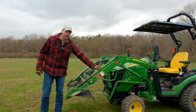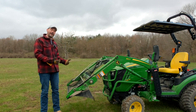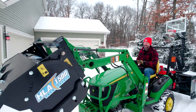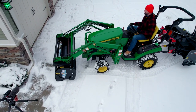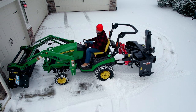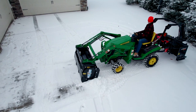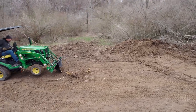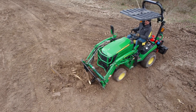Take a look at this rod — it's part of your curl roll. If you have a bucket full of dirt and you want to dump it, this is how you would dump it; it's made to just release material. However, if you are pushing and pulling with the stump bucket in this kind of scenario, you're really looking to cause problems on your tractor. Same thing can be said with the snow pusher — with the snow pusher you're on a smooth, level, clean surface and you don't need to be fully extended anyway. If you are driving forward or backwards and just digging into the ground against a stump with the stump bucket, you're going to have problems. Backhoe cylinders have the same kind of issue — they will get bent and torqued. You'll never see me with my stump bucket fully extended trying to dig; it will be at least partially retracted to give it more strength. I want to be at a forward-facing angle with plenty of rod back in the cylinder.